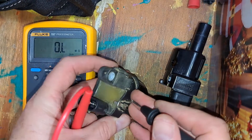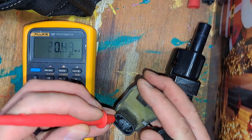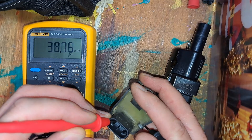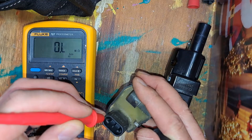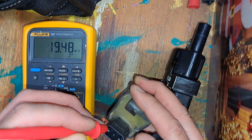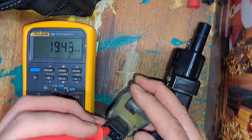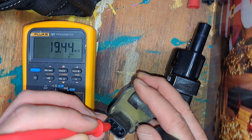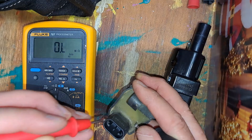Then your other check is ground to your pins. On the bad one, one pin is steadily climbing — it jumped up to 19 megaohms. Another pin shows 113 ohms. I got about 19 on the middle two, and the end one just keeps climbing.